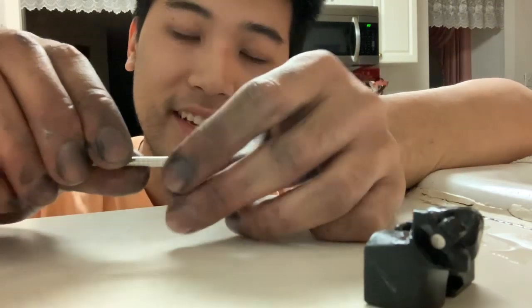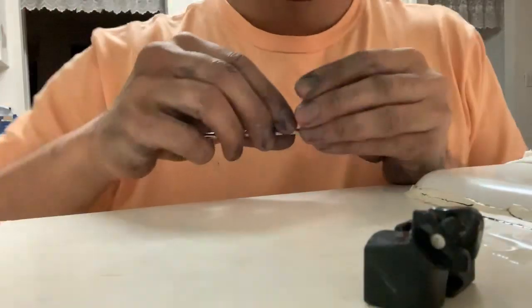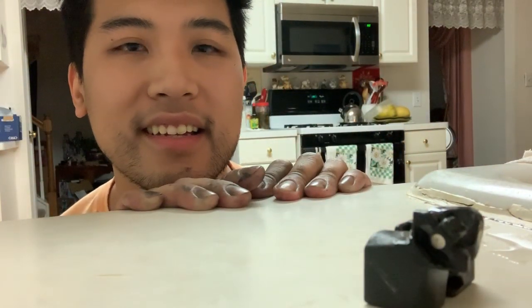These are attracted because they have that temporary dipole when touching the magnet, but when they're not touching the magnet they just fall off — that's pretty cool. Personally I think the best placement is edge-to-center. Once it gets too deep, the torque applied by the turn means you need really strong magnets to feel an appreciable change. The transition feels smoother but less tactile, and I think there needs to be a balance of tactility.